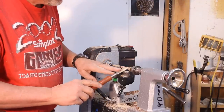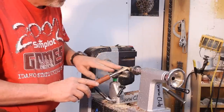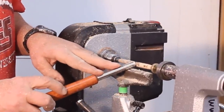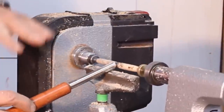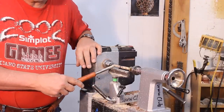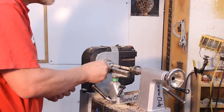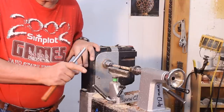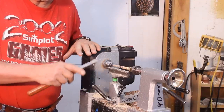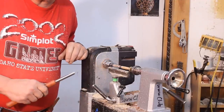Now you'll notice that I turn my tool in one direction or the other. If I'm working on the right bushing, I've got my flute opened in that direction. As I come over here, I've got it turned in the other direction. The headstock is always in the way if you're right-handed, so you may have seen me go to my left hand to hit this area over here. My next video is going to be on turning with your opposite hand — but that's another video. So I'm right there — I'm going to do a little bit of sanding and I'll show you my finished pen.